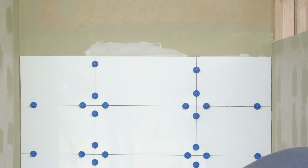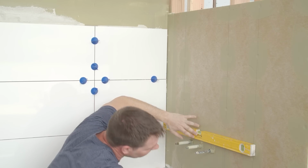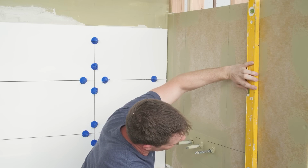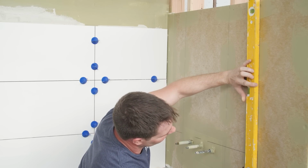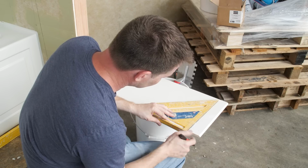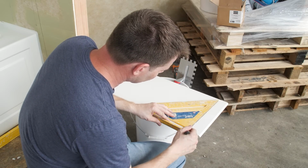When you're ready to begin the first side wall, start with the layout. Draw a level line that lines up with the grout joint from a tile on the previous wall. Determine where the bullnose or profile edging will be. The bullnose edge typically begins 2 to 3 inches just outside of the tub area. Again, cut the first course of tile that meets the tub.